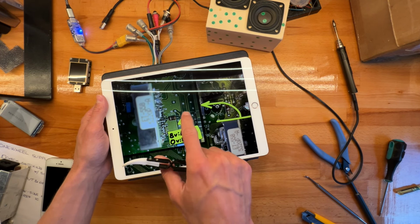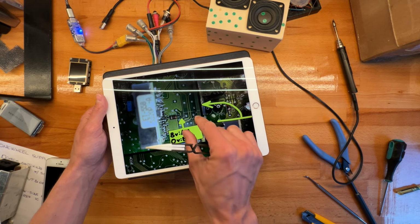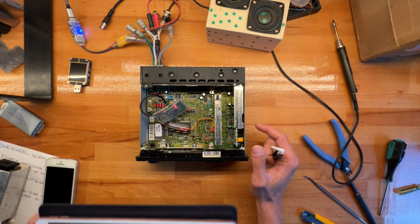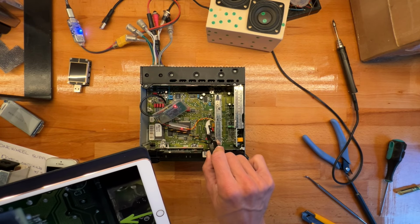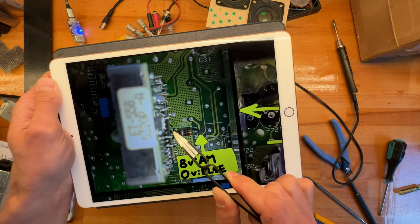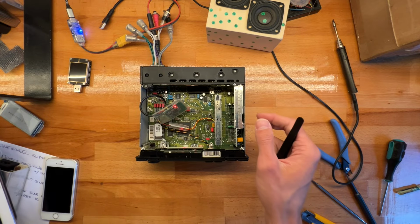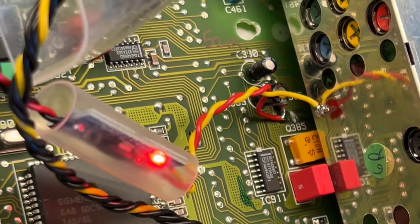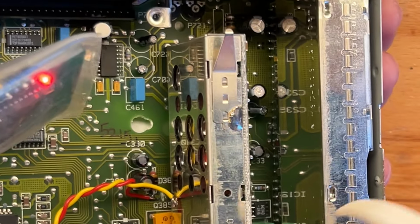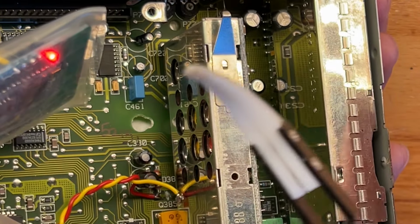And as for the supply, this is actually taken from my diagrams on the Becker BE1150. So this tiny module, which I was talking about earlier, has this ferrite, which is called D385 on the board, and it actually has the same D385 over here. It's moved ever so slightly, but you can cut this trace or actually cut this off completely and just take your 8 volts over here. I've done the same with this, in that I've scratched, as you can see, this part to kill whatever AM circuitry is in here, because this uses, I would imagine, quite a lot of power, and heats this thing up tremendously, right? This being in an enclosed metal box,